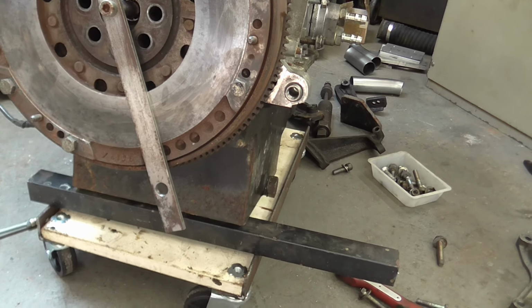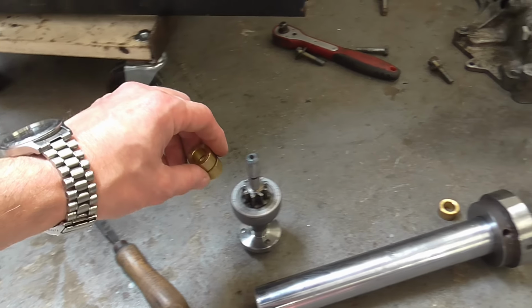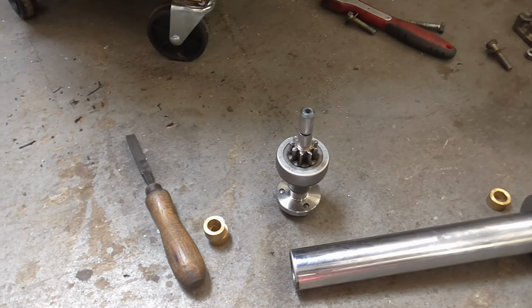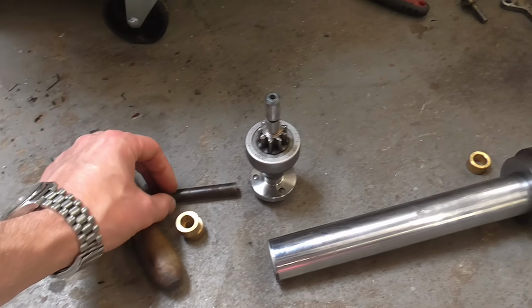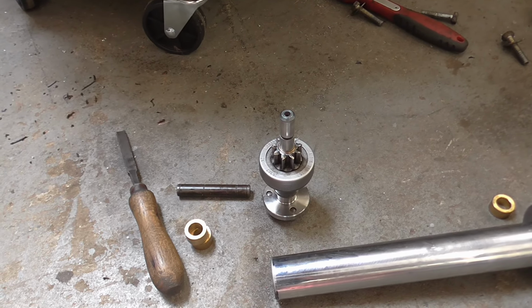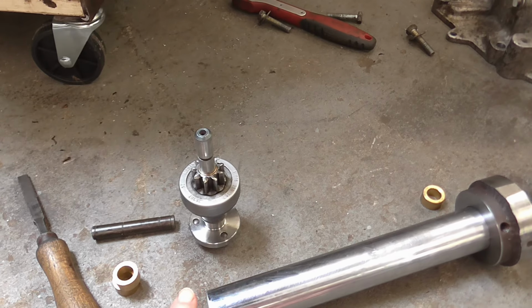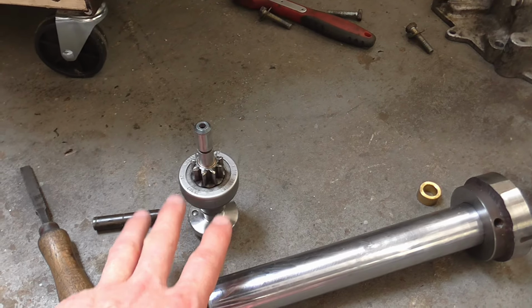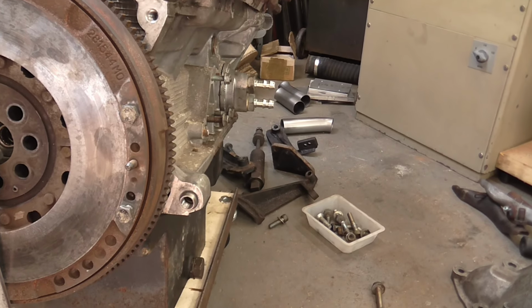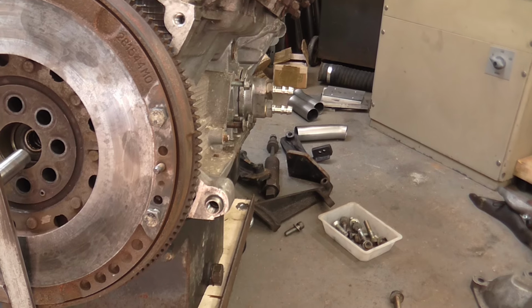And I'm not going to be able to set it up one-handed, but by using a Morini rocker shaft, which is 12mm OD, and some spacers to get it all sitting parallel to this bar, I was able to set the gear up on that shaft, aligned by the plate, and just do an in situ check of the gear engagement, which I was happy with.